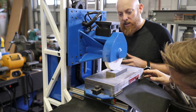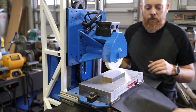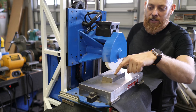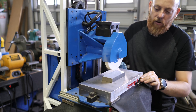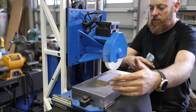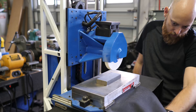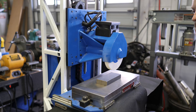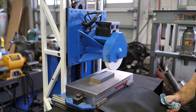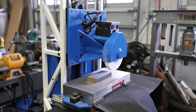Setting the Z height to just barely skim. The process: set the Z height, move back to the far corner, overshoot a little bit. The X movement is pre-programmed for a set amount — that'll change later but works fine for now. Make sure the wheel is past the edge, press the go button, and it moves over until it covers the whole surface. Then get the wheel spinning and let it go.